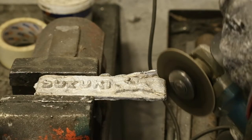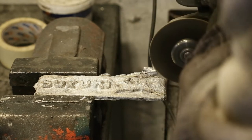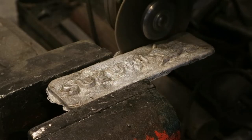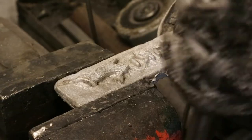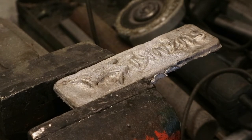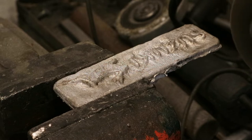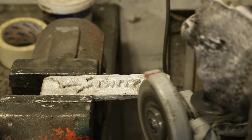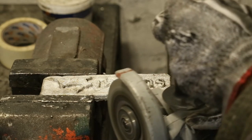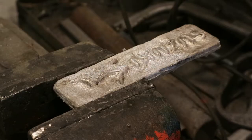Now it's a good time to talk about the rough texture of the piece. What I think happened is that the water in the mold didn't fully evaporate. Even though I left the plaster mold for more than three hours on the stove, that wasn't enough to fully evaporate the water in it. Therefore, when the aluminum, which was above 600 degrees Celsius, touched the surface, all the remaining water caused vapor, creating a very rough surface. For my next casting attempts, I'll have to get an oven and let the plaster mold cure in it for many hours.